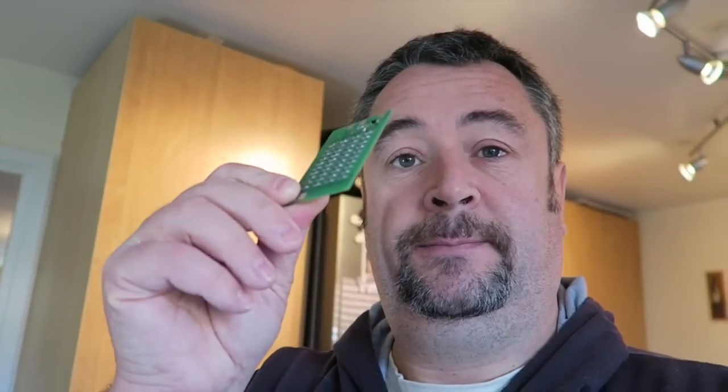So I had a look around and came across a technique which uses hot air, paste, and very little touching of the components, and I'm going to share that with you today. I actually built this — it's a surface mount based dummy load and it's a good introduction to surface mount and perfecting your technique.